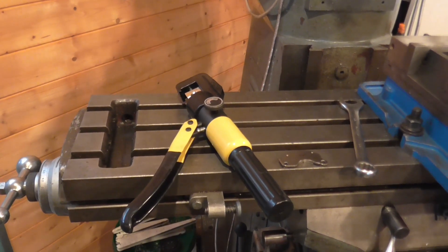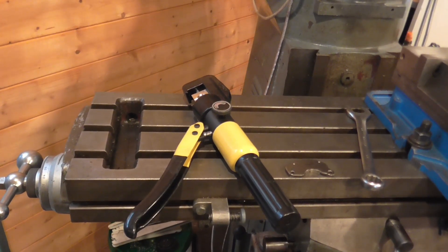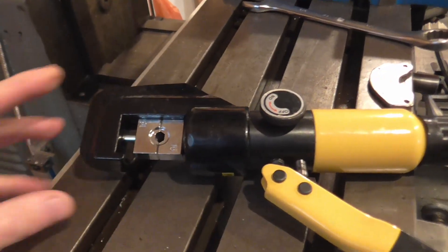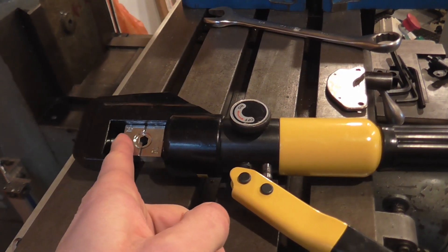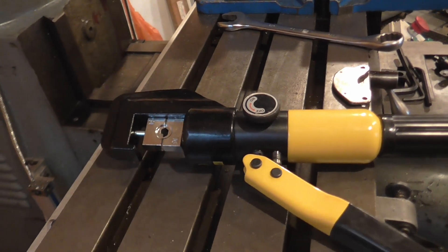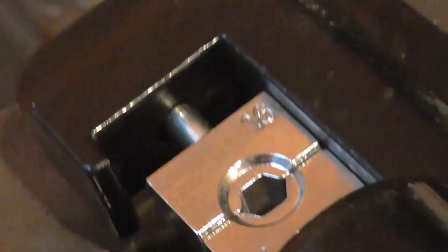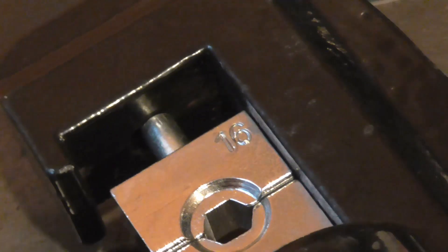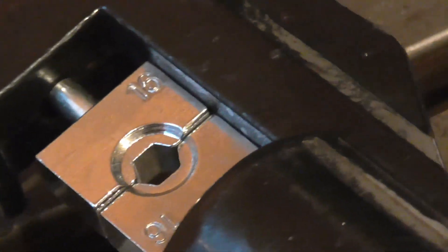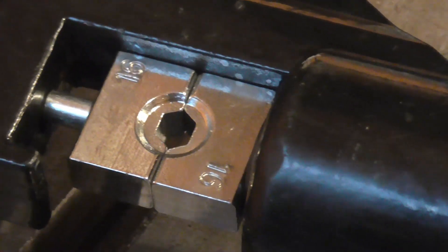It's clear the reason this particular set was cheap was they came off the reject pile. You can see I've got the dies lined up with a spigot sticking out the top of the top die — that's because it won't go into its locating hole. If it were to fit, the dies would be offset in two axes and I would not get a good crimp.